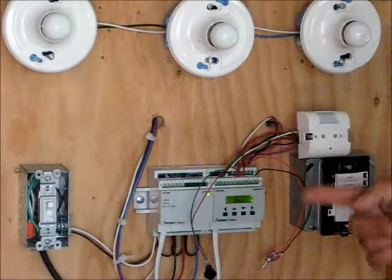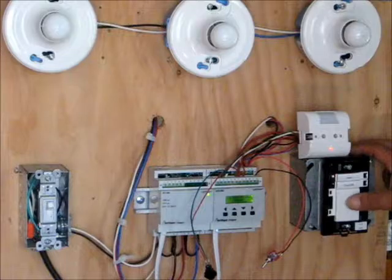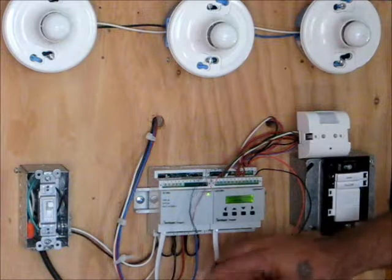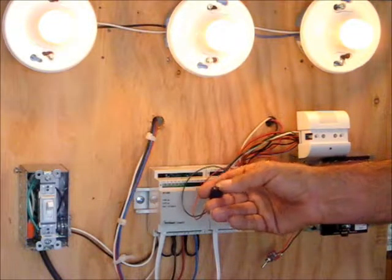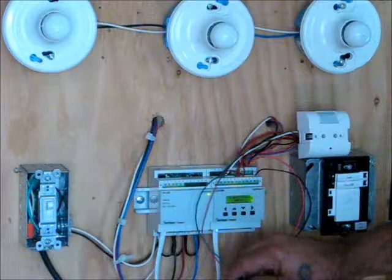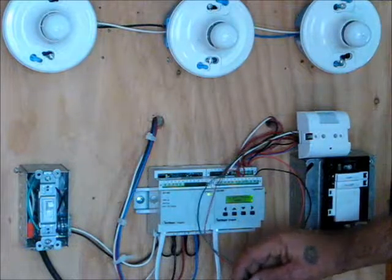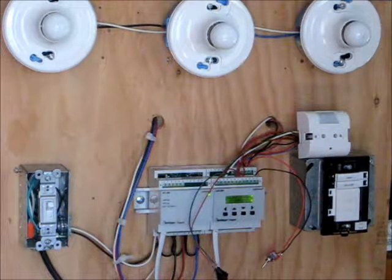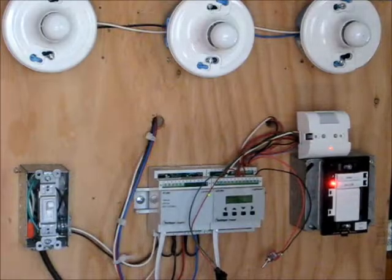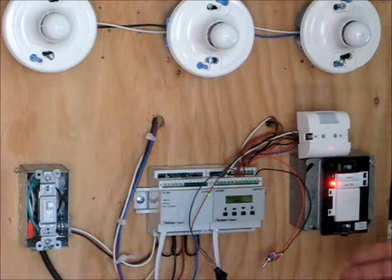Believe it or not, the manufacturer's instructions do not have you wiring the large button up. So let me give you my advice. Place the unit when you program it in manual on. Then you can use this button wired into what's called the door switch input to the controller. Then you can wire as many push buttons onto that contact as you wish and put area controls throughout the room. This door switch input toggles you between auto operation and off, which is what you want. You don't want to override the daylighting set point — when you hit this on/off switch, that's what happens. We'll show you how to fix that for total Title 24 Part 6 compliance in the state of California.